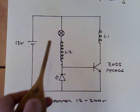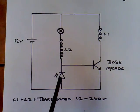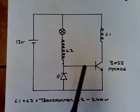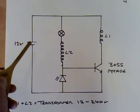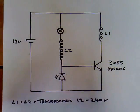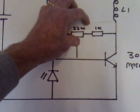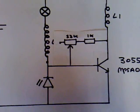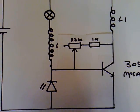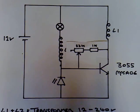My load is an LED bulb and it's non-conductive at the input voltages I'm using. This LED is for protecting the base emitter junction. To start the basic circuit you may have to tap a wire onto the positive, but to simplify starting it's better to add a 1k resistor and a 22k variable pot. That will self-start every time and you can adjust the brightness of the bulb.